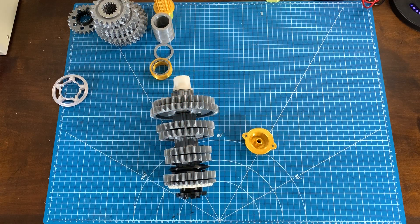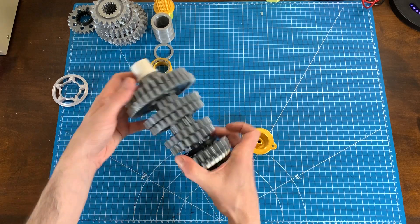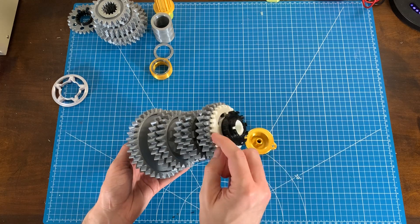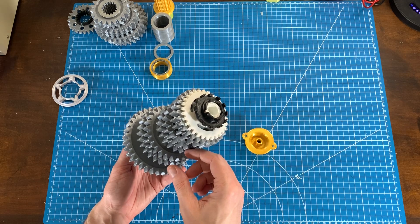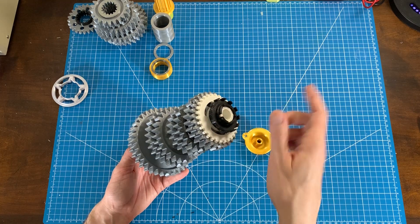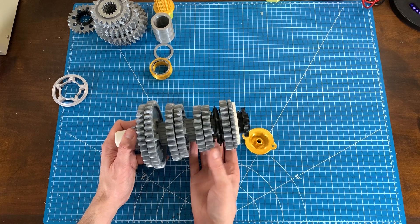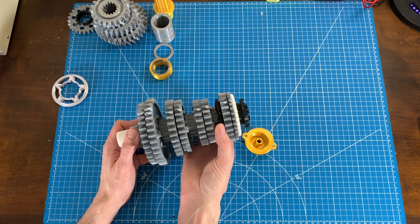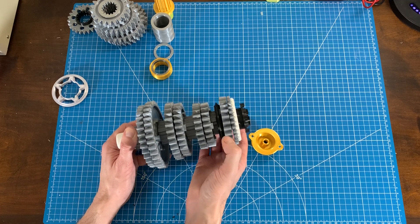Here's the assembled main shaft. As you can see, all the gears are actually rollerized against the shaft, minus the reverse gear which is splined to the shaft. There's a sensor ring on the end — I'm not really sure exactly what it's for on the F1 transmission, I just copied it. I've added my own sensor ring for a photo interrupter so I can measure the shaft's rotation speed. I've only got one slider on here since the others are still being printed, but as you can see it slides back and forth and locks the gear to the shaft.